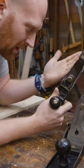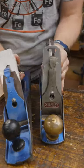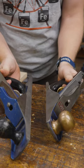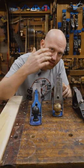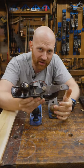One of the problems is these have become a bit collectible and you can buy the antiques now for almost the exact same price as the brand new ones. Most people end up taking a four or a five, putting a heavy camber in the iron, and calling it a scrub plane. It's a very affordable way to do it, and the nice thing is you can have one iron for scrubbing and then put another iron in and use it for its regular plane work.